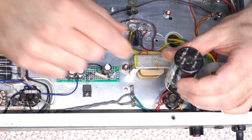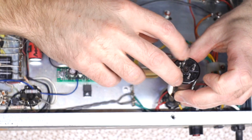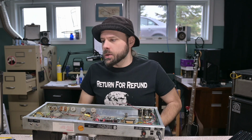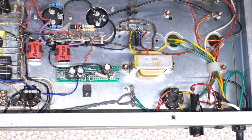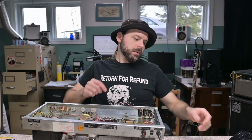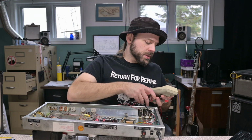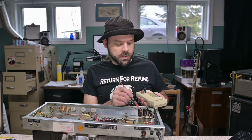But on most all rectifier tubes, you know, pins 7 and 3, and even 5, they've got nothing on them. I don't think I've ever met a rectifier tube that had something on 7, 3, and 5. So, you know, we could stick some diodes on it, use the socket itself as terminal strips, and get power over to this guy. Now, I want to do a continuity test on that switch to figure out which side's which. So I want tube to be the up position. And the up position is the down lug, which pretty much mirrors what's going on here.